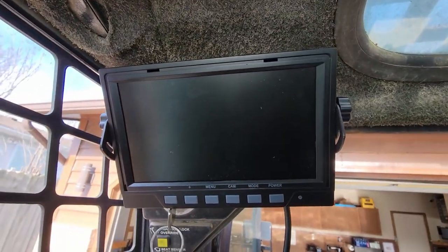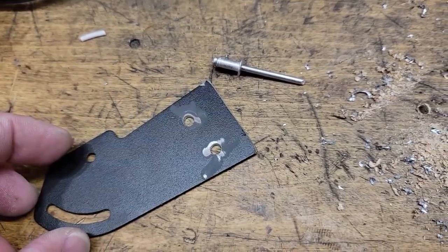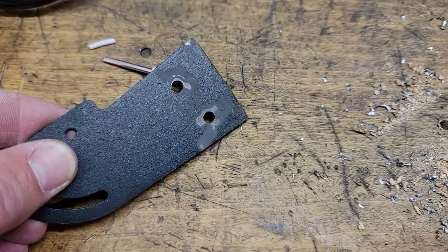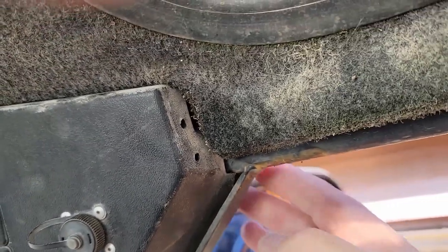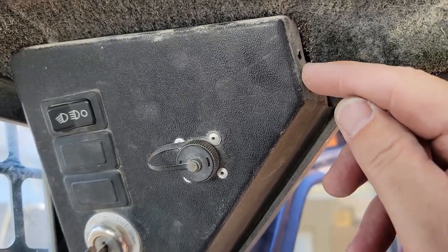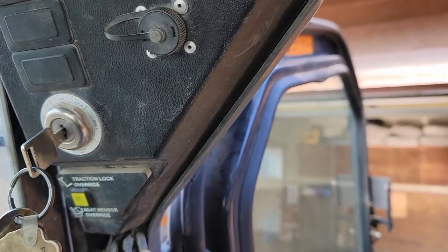It sits out far enough, I can still reach the light switch. Holes drilled in my bracket, and I deburred both sides. The plan is — I don't know what's behind that plastic — I'm going to poke around there a little bit, try to make sure there's no wires in the way. I'm not sure how thick it is either, so I'm going to drill a hole and I'd like to just pop rivet it rather than screw it. This is a 763, but you can see there's a cable there and a little bit of plastic going back. That just goes back to the other side of the cage, and there's a screw holding this on. It's only about an eighth of an inch thick, so I just very slowly drilled through and pushed back to make sure nothing was there. I just barely caught the bottom edge of this plastic, but I'm still well away from the cable. I'm only going in a little bit — I'm going to rivet that.